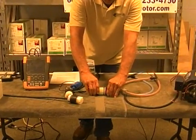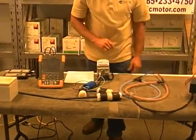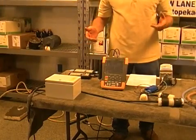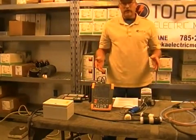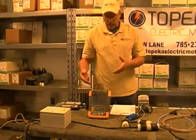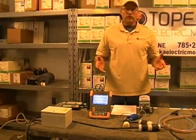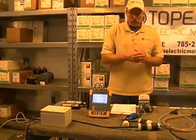First thing I want to show you is: years ago, before the introduction of frequency drives, most motors were just ran across-line start. We didn't have bearing problems and failures because of frosting and fluting. If we did have frosting and fluting back then — not run on a frequency drive — it was because the motors were actually designed asymmetrical or there was an unbalanced voltage. Our static phase converter will actually demonstrate the power signal that the motor will see running across line, and will show us how clean the signal is — and that's why we didn't have bearing failures.